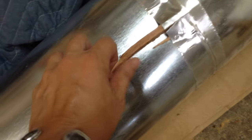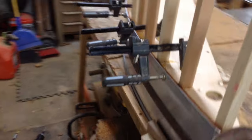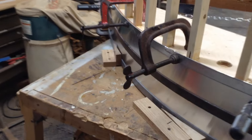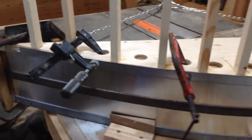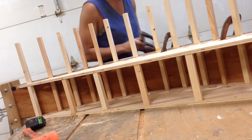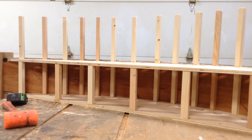I attached the piece to the form, but when I connected it, I hadn't cleaned out the seal in the middle, so a piece of wood got stuck in that lip and I wasn't able to get it out. Luckily, the second bent piece only has to be six inches, so I was able to rip that section off. The one problem with filming steam bending is you have a very short time to bend — especially since it took so long to get it out of the steam box — so I didn't have time to move the camera on the first bend.